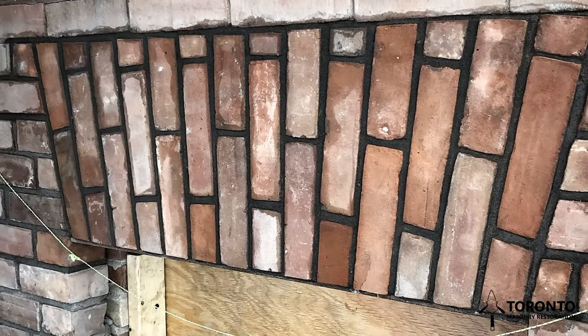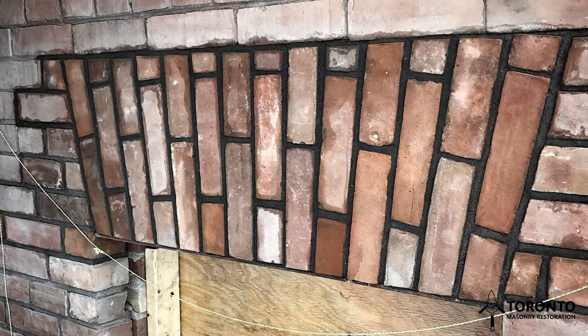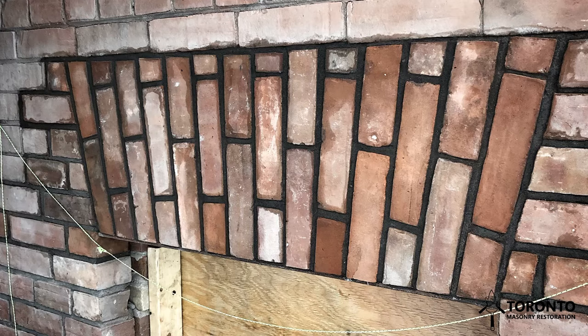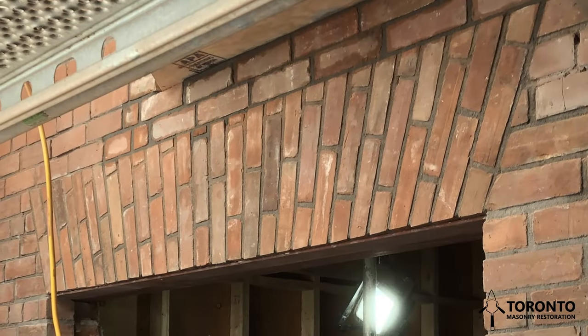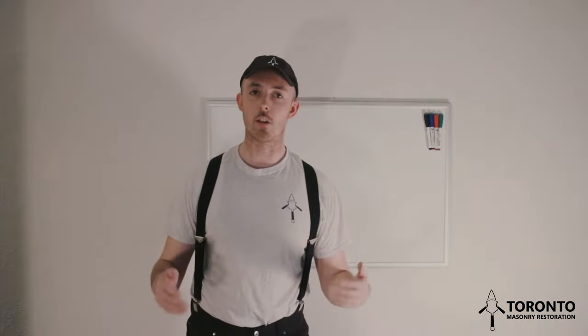You'll typically see them above window openings, and they're more commonly found in Georgian and Edwardian architecture here in Toronto. Now, the design of the arch will be determined by the building you're working on. If it's heritage work, the building may already have arches, and you'll simply be recreating those arches, or else building a new arch to match in with those old arches. Details to copy include the height of the arch, the bond, the skewback angle, and the design of the bed